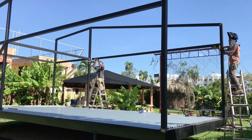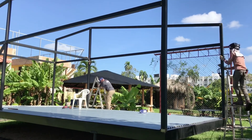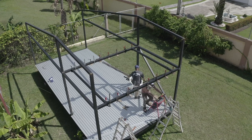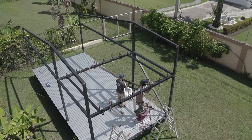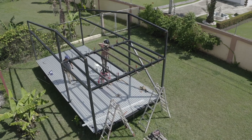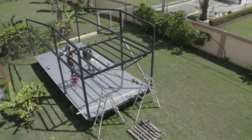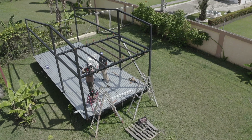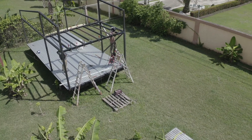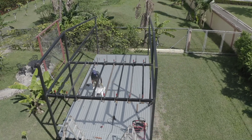You may be wondering why I chose metal roofing as a subfloor. It's moisture-proof and bug- and rodent-proof for the most part, and leaving the webbing underneath the bar joists open allows for putting in plumbing, electrics, and whatever upgrades I need later. I'm planning to put styrofoam or spray foam insulation underneath, and on top I can do porcelain on styrofoam with cement and mesh, or wood flooring, or heavy-duty vinyl flooring right on top of the metal. For the lofted section, I actually purchased hardwood flooring because it's very beautiful and makes a great platform for laying a mattress on. I'm still working out which stair design will work best up to the lofted bedroom.